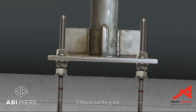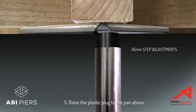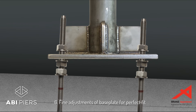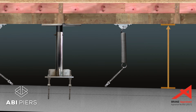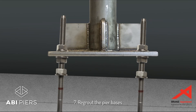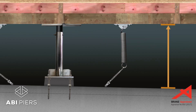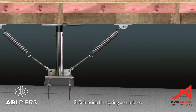Re-level piers by adjusting the nuts above and below base plates. Raise the plastic plug at the top of each post to the closest it can go to the pan above. Adjust base plate nuts until the plastic plugs bear firmly on the underside of the pans. If there is insufficient adjustment, taller piers are available. Once all plugs are firmly supporting the pans, re-grout the pier bases, remove the jacks from under the house, and finally reconnect and re-tension the springs.